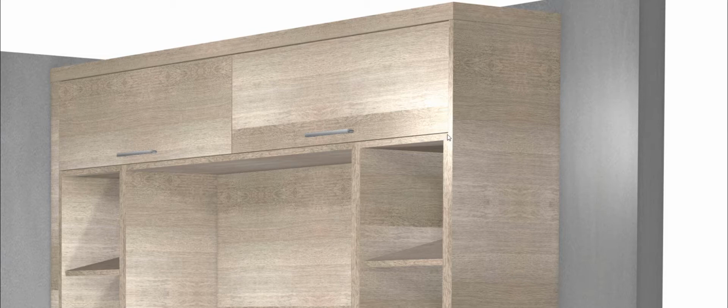So when you have these, there is going to be a little bit of a seam, but that's going to be on purpose. It's going to look like you have a 1.5 inch stile running there. And a stile obviously is the one that runs from top to bottom, and then this would be like a rail. So you have a 3/4 inch rail, which is really just the face of your top of the alcove cabinet here. And then you have over here, same thing, the stile, and then you got your seam here where this filler connects to the door and to the edge of this cabinet. There's really nothing you can do about the seams, but the nice thing is that they are going to be a good looking seam because there's some treatment there.